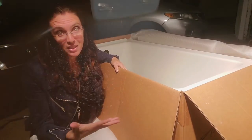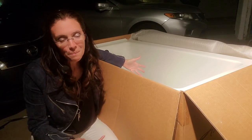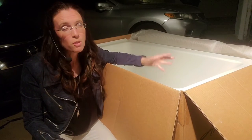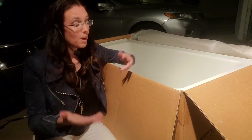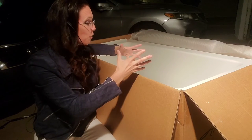Third, look for imperfections in the surface of the tub. While this may be superficial, it is not something you want to see on day one, the first time you get to use it. This isn't just looking for scratches all over the surface. If there's extra texture on the bottom of the bathtub — some reviews describe it as looking like oatmeal — one spin is that it's extra slip resistance, but if the surface is truly a defect with a lot of bubbles or pits, it may be a manufacturing problem. Check this before putting down a protective layer, because tile, tools, and constantly stepping in are going to scratch the surface.